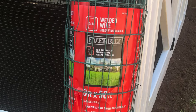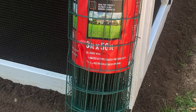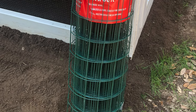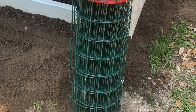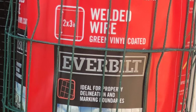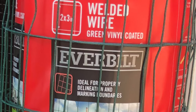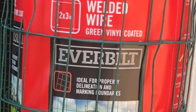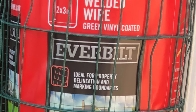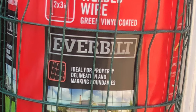Your digging predators are typically going to be pretty strong, which is why we recommend a 14 or 16 gauge thickness welded wire over something like hardware cloth, which is very thin — typically only 19 or 23 gauge. Another nice thing about the welded wire product is a 50-foot roll with a three-foot width will typically run $38 to $50, which is more than enough to cover your typical six foot by twelve foot coop perimeter.